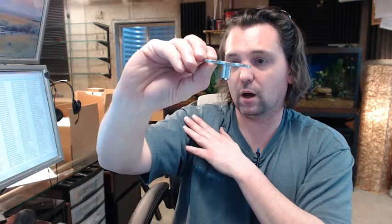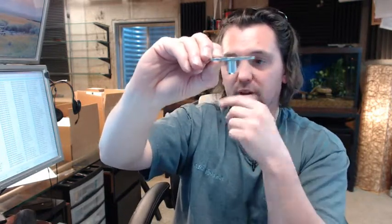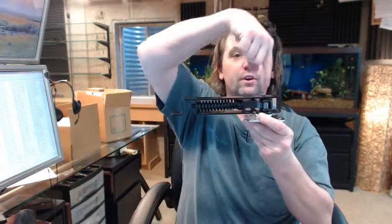Obviously in the door, the second part of step 2, you've got to drill a 5/8 hole, 5/8 deep, to allow for the stud to come down. So your 1.5 dimension is really important. That's where this is going to go. That's based on a 1/4 inch margin, obviously. No, it's not directly based on that. But keep in mind, from the edge of the door, 1.5 is what they want. That's important because that is in step 3. You've got to make sure that your vertical axis of pivoting matches up with the bottom. We'll get to that in a moment.